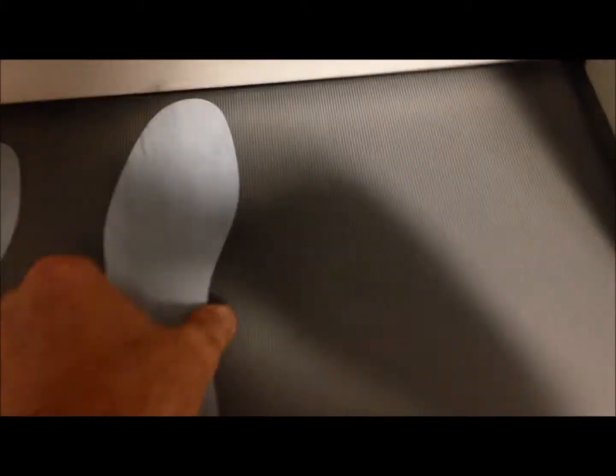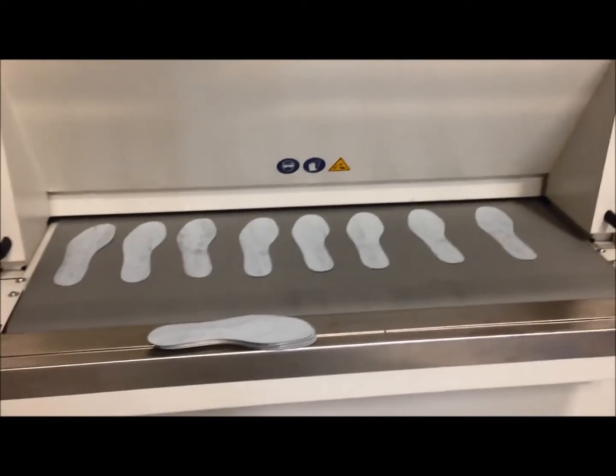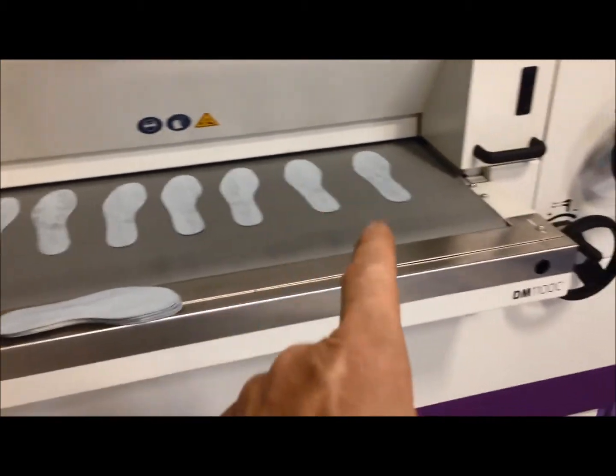One way to determine how many parts you can run is simply to determine how many parts you could put side by side on the machine comfortably and quickly. And the question is if you can even load them as quick as what the capacity of the machine would be. I calculated the capacity, and I think it far exceeds by a factor of 5 to 6 your annual volume of 1 million parts. As you can see, we can put a total of 1, 2, 3, 4, 5, 6, 7, 8 parts side by side with a generous spacing in between.